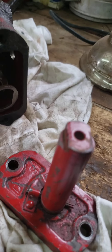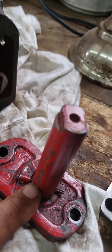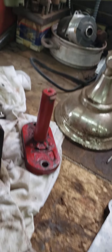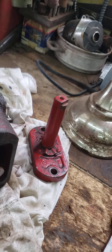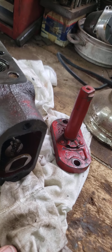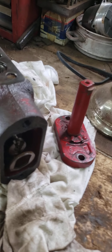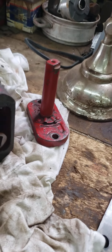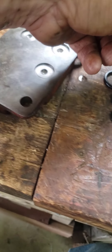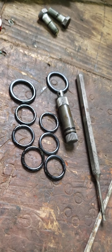A lot of these little tractors you'll see this selector sticking up out of the tin and wonder what it is — it's the single/double action selector on your hydraulic valves. Some you'll have one hole, some two holes, some none at all, just depending on what option the original purchaser decided he needed at the time.